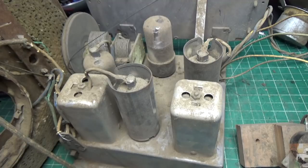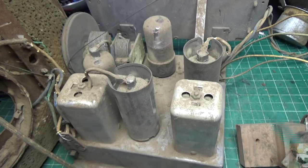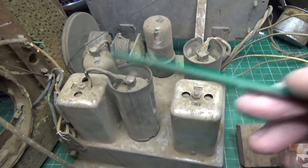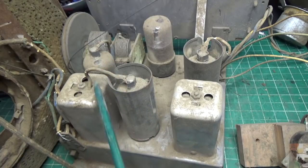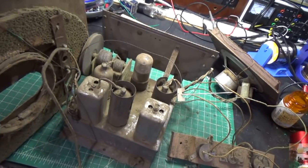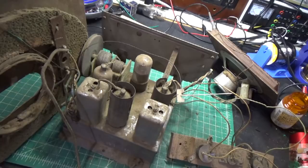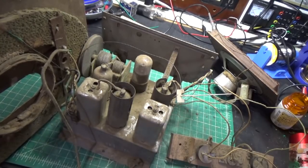Let me start documenting the radio. Look at this wire right here going to the grid of this tube — it's cracked, so all these wires will have to be replaced. This is a gentle exercise because these are going into the IF can, so we're not going to remove those cans — we'll probably have to cut and splice there. Also, I mentioned in my first video I was going to try to hook up the battery eliminator, but with the shape of these wires there's no way. This is not getting powered up until the wires are changed.